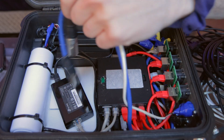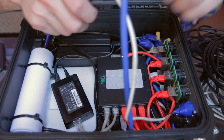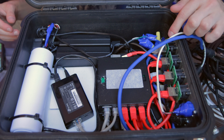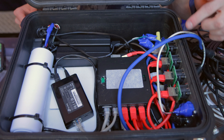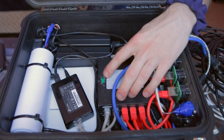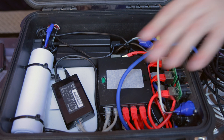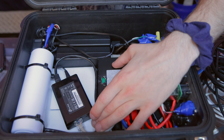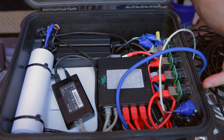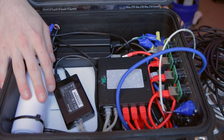You can remove the foam to see all the guts. Up top we have two XLR cables, both terminated to male XLR — one for input, one for output into an ArtNet node. On the side are all our EtherCON ports: a black one for the WAN connection and silver ones for all LAN connections. We have two little 50-watt Amox POE switches — 50 times 2 is 100 watts of POE budget across all ports. The USG is powered via a TP-Link POE extractor so I don't need room for its power brick, and a Flex HD access point is zip-tied and shock-mounted to the side.